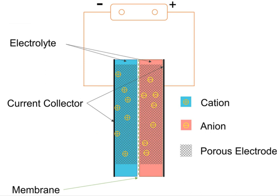Incorporation into batteries. The ultrabattery is a hybrid rechargeable lead-acid battery and a supercapacitor invented by Australia's National Science Organisation, CSIRO. Its cell construction contains a standard lead-acid battery positive electrode, standard sulfuric acid electrolyte and a specially prepared negative carbon-based electrode that stores electrical energy with double-layer capacitance.